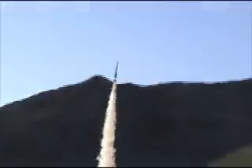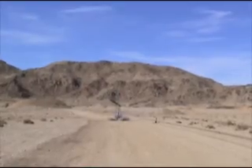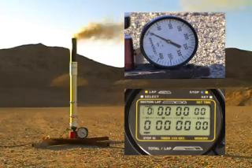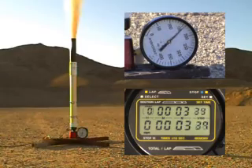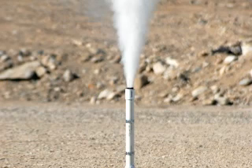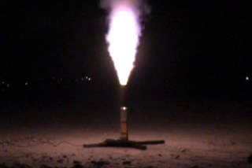That was the fate of Coyote prototype number one. We had five people watching the rocket and no one knew where it went — we never saw the parachute or heard the rocket come down. It became clear when I looked at the video of the launch that something was wrong; the speed of the launch was dramatically slower than November flights. The blast tube must be generating huge friction losses for the engine. A static test of the K450 with the blast tube confirmed this — the K450 with the blast tube had a 19% reduction in power output. Putting the blast tube at the end of the nozzle may successfully move the center of gravity forward in the rocket, but the added weight of the tube and the high friction losses to the engine seemed to be the final nail in the blast tube coffin.